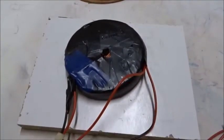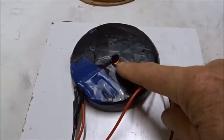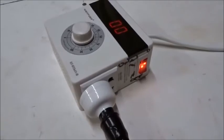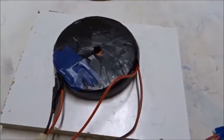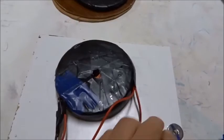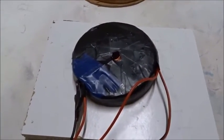If you take the one wired in series, the wire goes in here all the way about 500 turns, then it goes to the center, comes back out, turns on the wire and does that again, then it goes out to a power supply — AC 100 to 200 volts, isolation transformer — and we can put AC power to it that way. Now we're going to turn it on. You can hear it humming. We put a magnet on the series coil and it just jumps right off. You can't do anything else with it. So that's what it does — it repels.